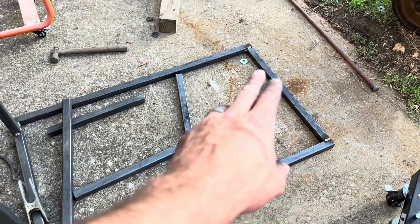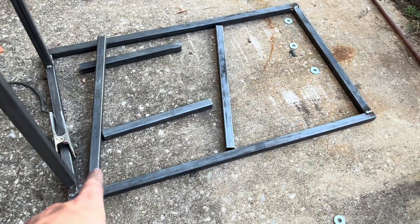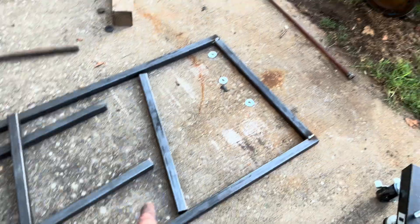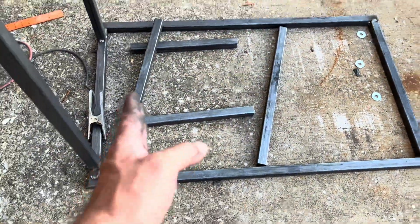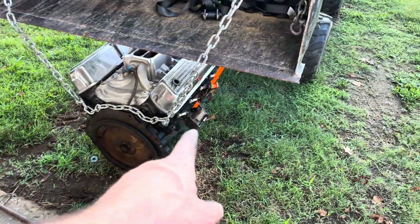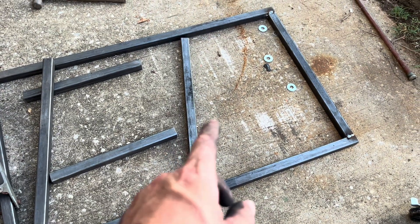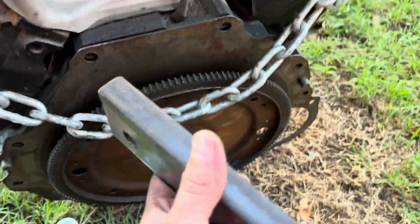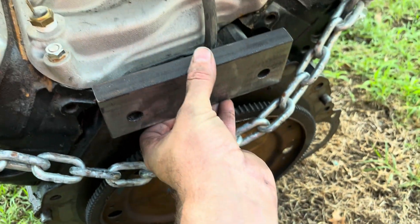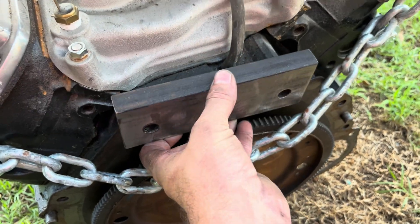There's our basic stand platform — the gauge stand, the wheel base. I don't have those welded in yet but this is our basic structure. Now I'm going to weld this piece right here up exactly where I want the rear mount of the block. Once I have that exactly where I want it, I'll measure up to where my mounts are going to be. I made this little plate out of half-inch steel — it's going to be the mount at the top that mounts the rear section of the motor right there at the top center.